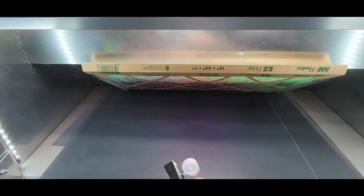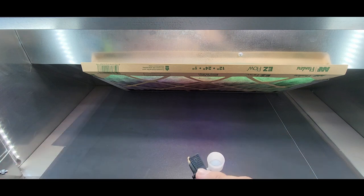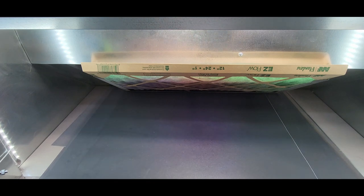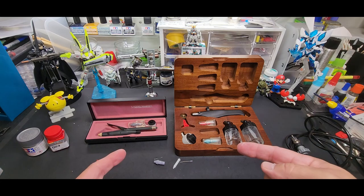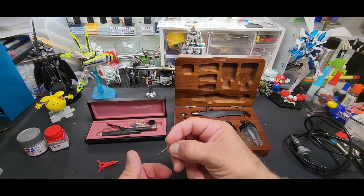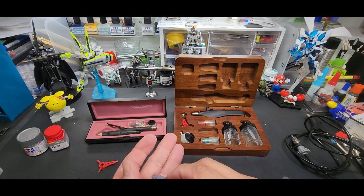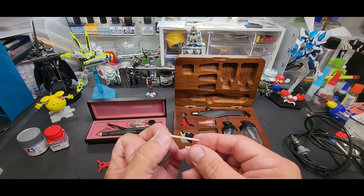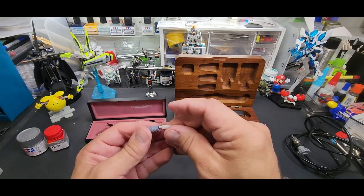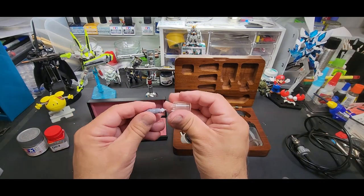Anyway, look at that — wow! Let's let this dry and clean it out just like before. Put the cup in the acetone, shot through the body. The cap comes right off — same thing, disassemble and throw it in. Back at the bench, here's the nozzle that was soaking in acetone — look how clean it came out. I just dried it off without even rubbing it.